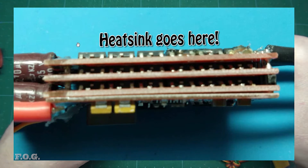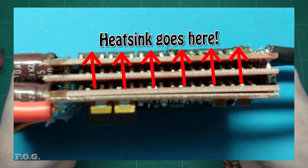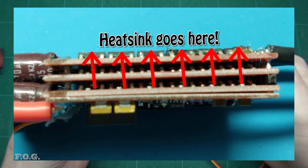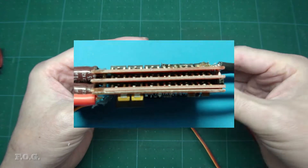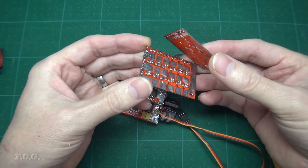At the other end of the board there's a 15-pin header strip which connects all four boards together in parallel — everything's just hard soldered together. The MOSFET boards are sandwiched together pretty tightly, and the outermost MOSFET board is where the heatsink is loosely located. This means the innermost boards must transmit their heat through the boards stacked on top, ultimately making its way to the heatsink facing outside. It doesn't seem like a great design, and one would assume the board in the middle must be getting especially toasty.